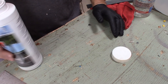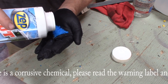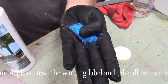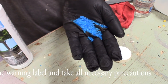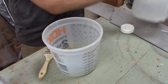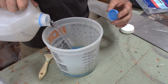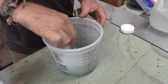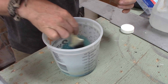One of the first things you're going to have to do is get yourself some Root Kill, or at least something that has copper sulfate in the product. You'll know it's copper sulfate because it is kind of a blue crystal type of substance. Pour some copper sulfate into a bucket and then just add water to it. I haven't worked out any particular ratios, but I used about a cup and a half of water and maybe a handful of the copper sulfate, and then you just stir it until it's dissolved.